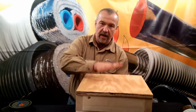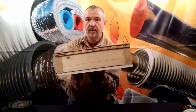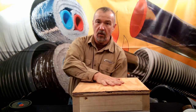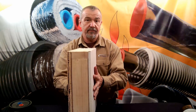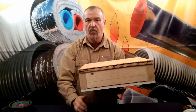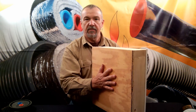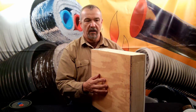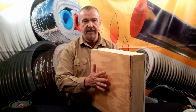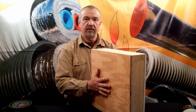Now the R value may be measured down, sideways, or up, and that number could be R11 for down, R7 or R8 for the side, and maybe R5 or R4 when they measure up. For these manufacturers, this is a perfectly legitimate way to measure their R values for products used in the construction industry. But let's see if these R values can then be transferred from the construction industry to the pipe business.